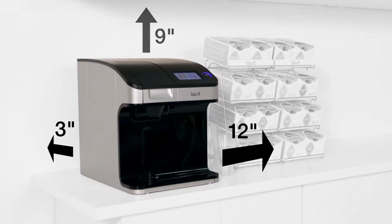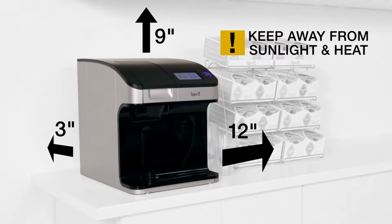Also make certain there is at least 9 inches above the dispenser in order to fully open the dispenser lid. You should avoid placing the unit in direct sunlight or close to a heat source. This will prevent overworking the refrigeration system.